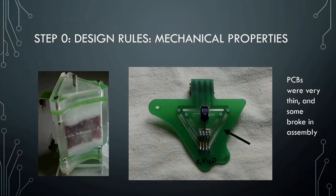There are also mechanical properties to consider. PCBs come in different thicknesses. In the case of my PhD, I needed a very thin PCB because I had a very tight restriction on the component, and all of those measurements are minimized as much as possible for clearance, manufacturability, and stability. This PCB was really stable once it was in the column, but a number of my collaborators were not very careful — they would bend it or break it, which made my fab even more happy with me because they kept having to rebuild them.